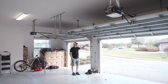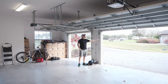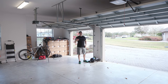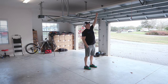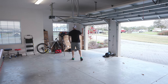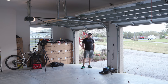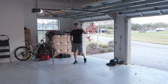We're also going to do high lift doors. I may have some powder-coated black rails done. The doors will stop somewhere around here and carry the radius all the way up to the ceiling. We'll do Liftmaster 8500 jackshaft operators. This is an 18 foot door and this is an 8 foot door — I wish they were 8 by 8, but they're 8 by 7, only seven feet tall. I don't even know if the Raptor will fit through the doorway. I think the Raptor might be a little taller than seven feet.